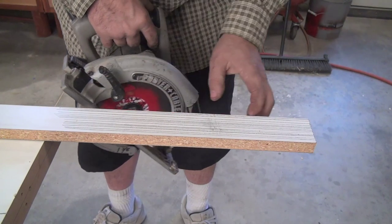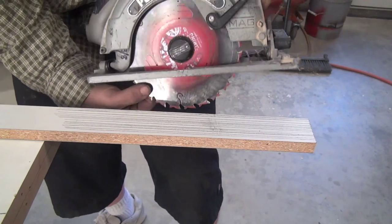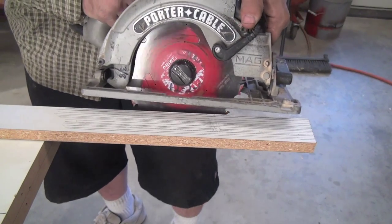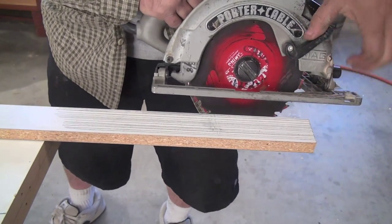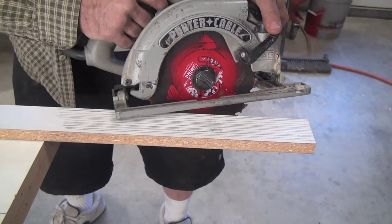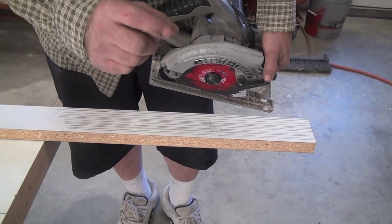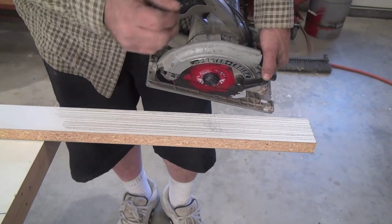The trick to not get blowout when doing this: when the blade spins, the teeth are going up. You want to make sure you lean the top of the blade slightly away from your cut — instead of burying that end into the piece you just cut, pull it away slightly. Also, when doing this technique you're only going to want to be taking off a maximum of a half inch at a time. If you go more than a half inch, it becomes a little harder.